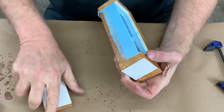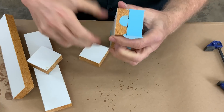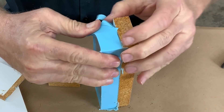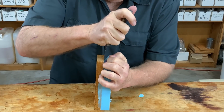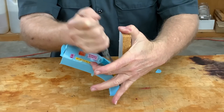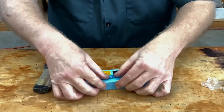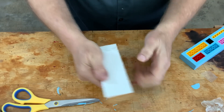This side of the mold is easy. The next side is where all the fun starts. Let's pop this mold open. The wax is doing its job perfectly. But the rubber is bonded to that tape. I got a putty knife with rounded corners so I won't gouge the silicone and I just need to work it down in here. The amazing thing is that the tape is bonded more tightly to the silicone than to the laminate of the case. Any chance of not dislodging the Lego pieces from the first half of the mold is gone. We'll just have to hope that when I pour the second half, the rubber doesn't leak between the Lego piece and the mold. That tape is really bonded to the rubber — somewhat surprising. I had hoped silicone would resist the tape, but no such luck. Now we can go through and clean up the mold.